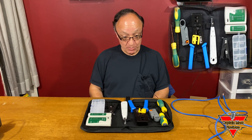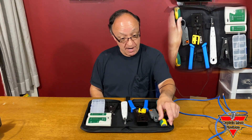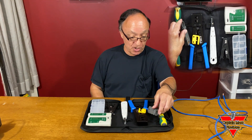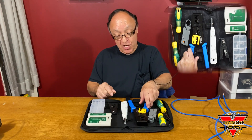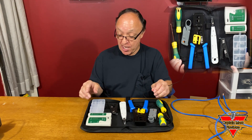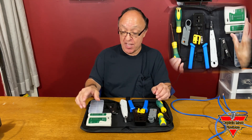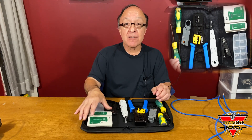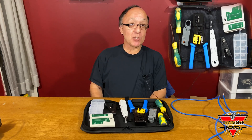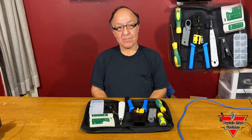Well, this kit is awesome looking. It's got all kinds of stuff for you. It's got a Phillips screwdriver, a regular screwdriver, a cutter that'll cut your cables and your coax. It's got another one that cuts your cable coax. This is for your Cat 5 — it's a cutter and connects it so you're able to put connectors on there, and it will line up the wiring because you'll have some wiring issues. And then the main thing is the tester. We need that tester to make sure we do everything correctly and completely. It'll tell you if you did your connections correct.